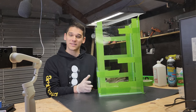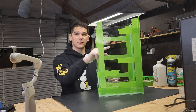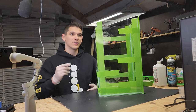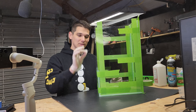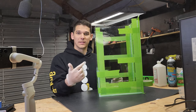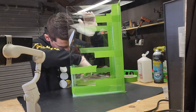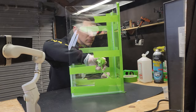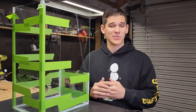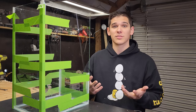The silicone is applied to all the seams and that's good to go. Before leaving it to cure, remove the masking tape from the inside so the silicone doesn't cure on it and become difficult to remove — pull the tape away really slowly so you don't make a mess. This thing needs to sit for a full 24 hours to make sure the silicone cures correctly and is nice and waterproof. In the meantime, there are other things we can work on.